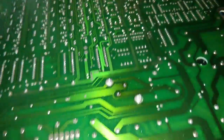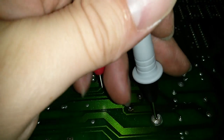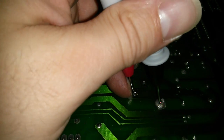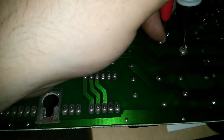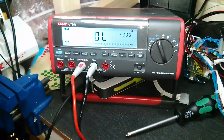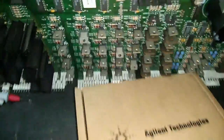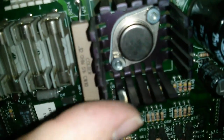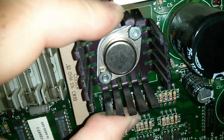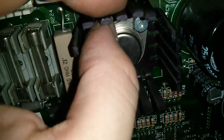I've just fitted the new device, and I thought I would quickly test from ground to output and input. As you can hear from the beep on the continuity - we were getting a short there. And the reason is the legs pass through some small holes on this heatsink, and obviously it's just slightly out of alignment. If it's slightly out of alignment it touches the heatsink and you get a short. There's not very much play in it.